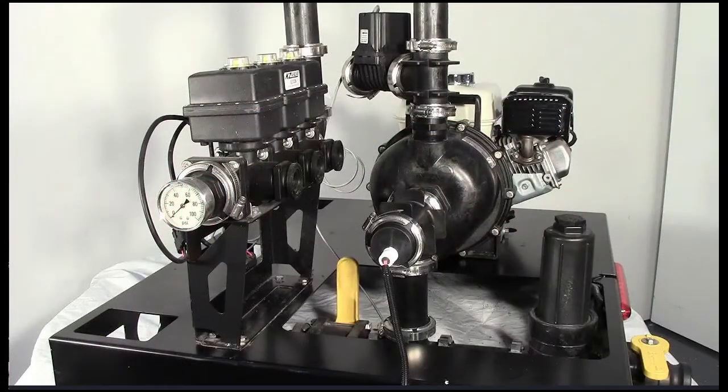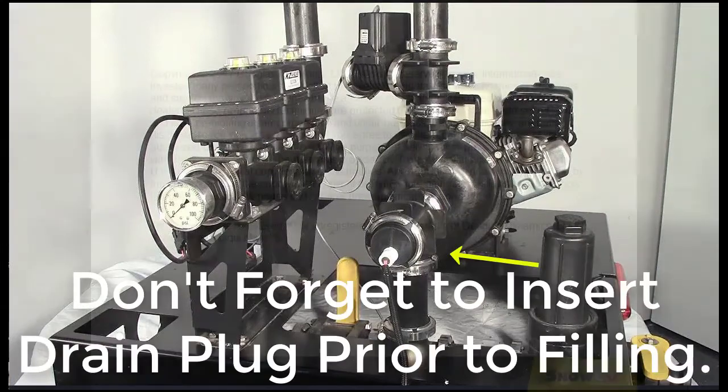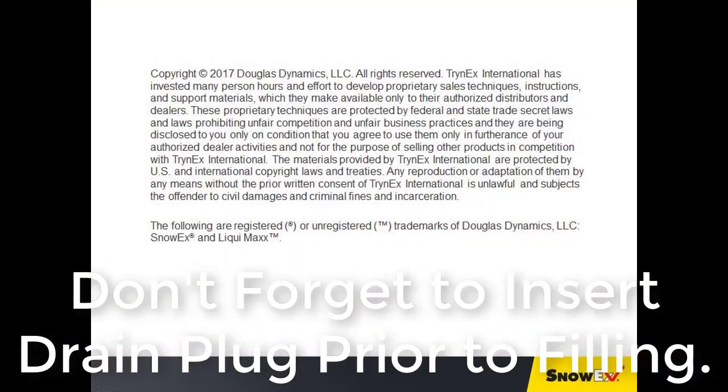Refill your liquid tank and pull start the engine to verify functionality once hooked up to your main tank. If the engine will not start, it may be necessary to purge the air in the new T fitting to ensure the float switch rises. Loosen the band clamp on the level switch coupler and separate until water begins to seep from the fitting. Secure the band clamp and start the engine.